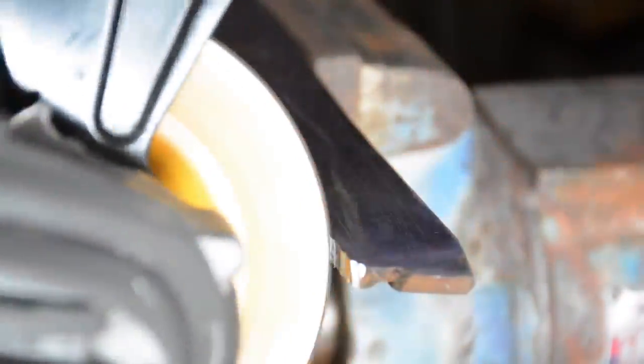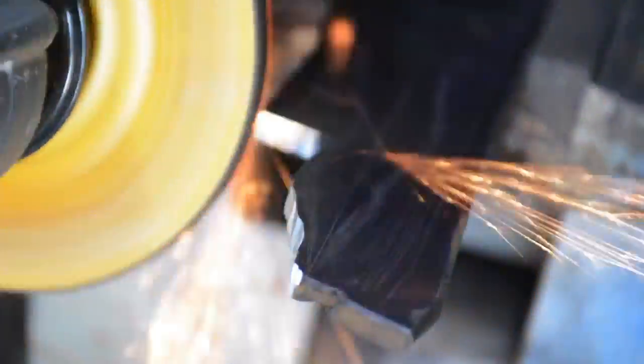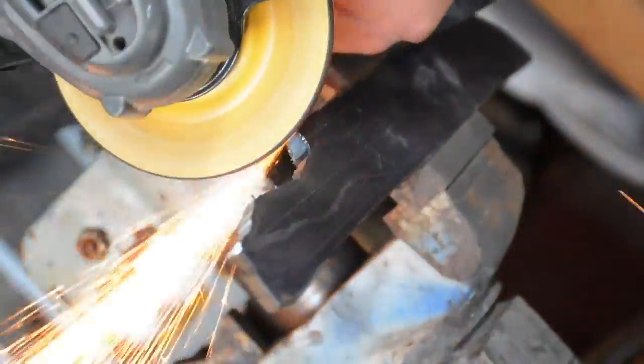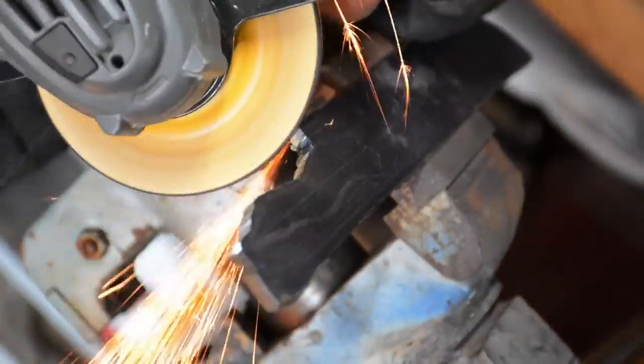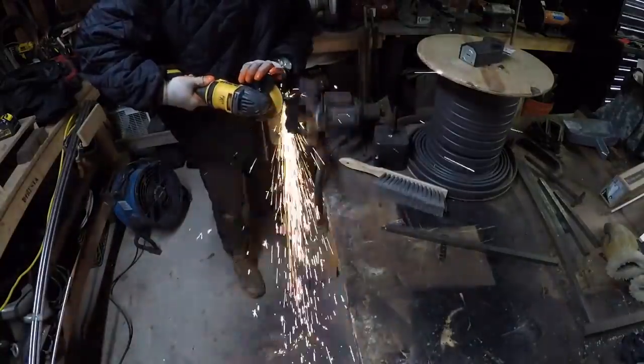A lot of people ask me why I didn't just bandsaw this shape. It's because that piece of metal is tooling steel, and even though it's not hardened, it's still extremely taxing on a bandsaw blade. I probably wouldn't have been able to get through 2 or 3 bandsaw blades before I was finished cutting that out. And I tend to save these little scraps and do nothing with them over the time, so I just turn those little scraps into dust by using a grinding wheel.